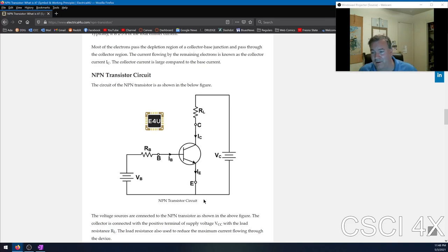Like it'll wear out, right? Relays are not designed to be turned on and off really quickly. It's like flicking a switch on your parents' light switch, right? You get tired of that real fast, right? The physical contacts will wear out.